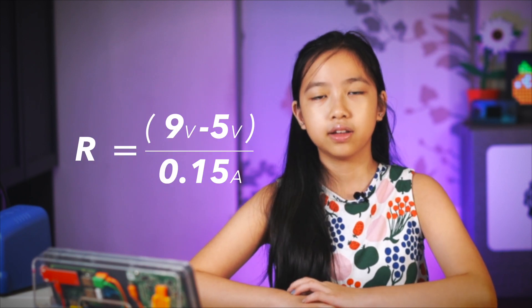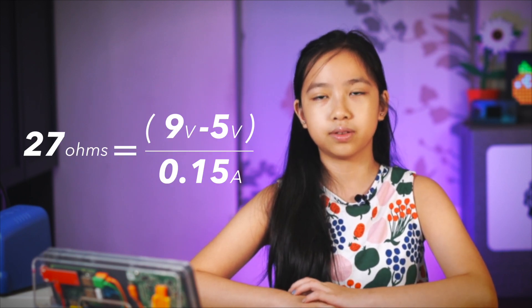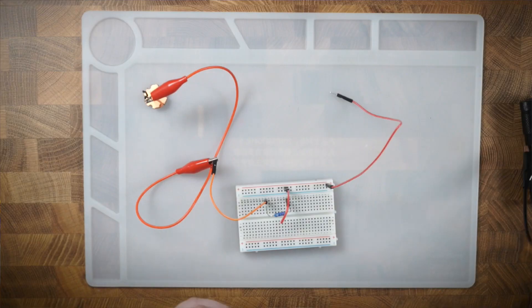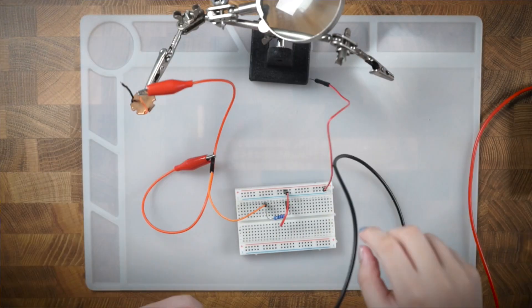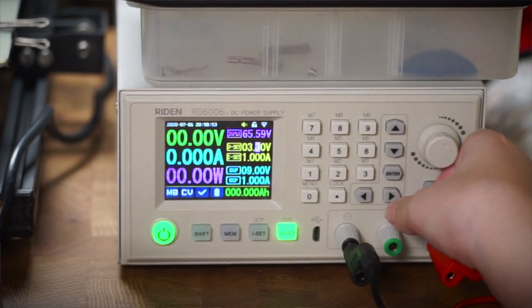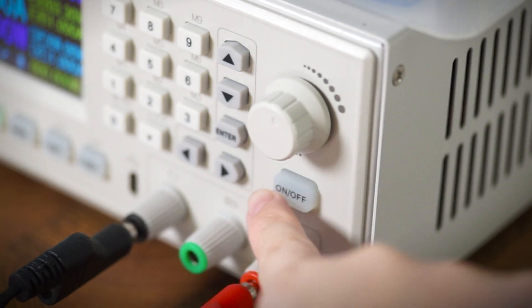For my particular LED it has a forward voltage requirement of 5 volts and a current of 150 milliamps. My power supply was 9 volts, so using Ohm's law the required resistance would be 27 ohms. With the properly rated resistor I made a simple prototype circuit. I used a benchtop power supply so I could easily test and change components without needing to worry about batteries.